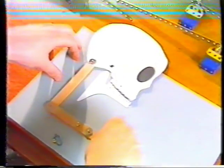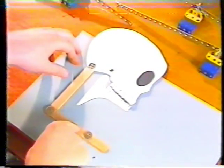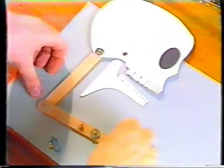Put a nose on. The best thing would be to try one — make one and see how it performs. It's much better to think about the mechanism using very easy-to-work materials like cardboard and lollipop sticks, which you can shape easily, and get a mechanism which works from that before you go on to do it in a much more difficult material.